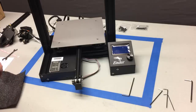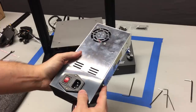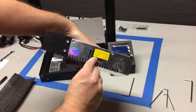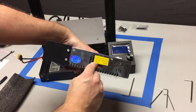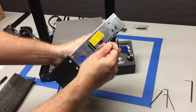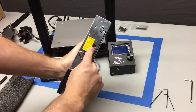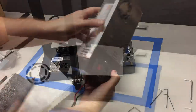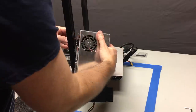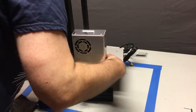Next up is your power supply unit. This is going to take M4x20 screws. Here you have a choice of 115 or 230 volts — if you're in the United States you want 115. Just use a hex wrench and slide that red slider down; it should say 115 and match what it says on the left-hand side of the yellow sticker. If you're anywhere else, check what type of voltage you need for where you live. Go ahead and tighten those M4x20 screws.